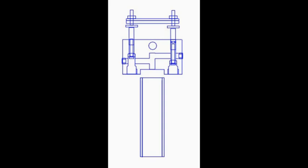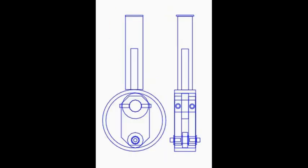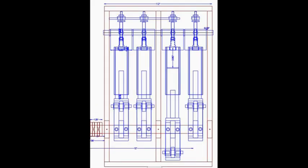For my new design, it will have four separate what I call modules. Each module will have a valve head, a cylinder that screws into the bottom of the valve head, and a push rod piston attached to a ring with an internal drive shaft rotator. The modules will be positioned vertically on the drive shaft, one behind the other in a straight line. Each module will have a separate airline and will run independently, but in series with the others to turn the drive shaft together. Since there are four modules there will be some overlap, so the engine will always be ready to start the drive shaft as soon as the air is turned on.